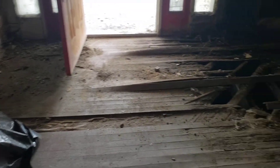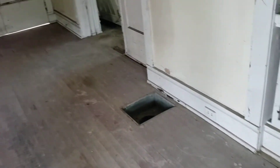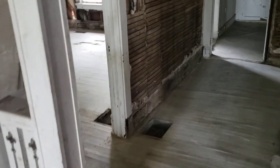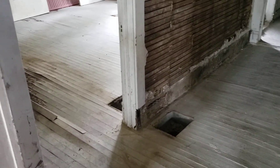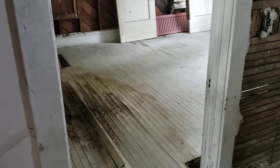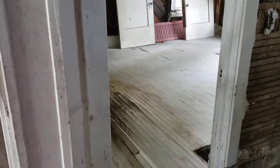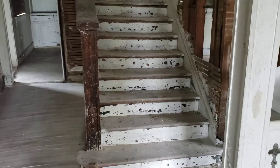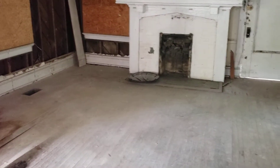As you can see, the floors actually aren't in terrible shape overall — of course there's a huge section here at the front that's bad. I don't know exactly what's going to occur once my contractor comes in and tells me what I need to do to get this house level. You can almost see a bow right there in the wall that's eventually going to be a bedroom — it's pushing in right in the middle. Also, these stairs are shifted to the right-hand side when you're viewing this, so a lot of structure underneath needs to be shored up in the basement.